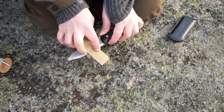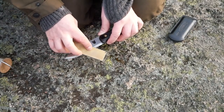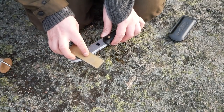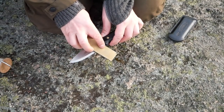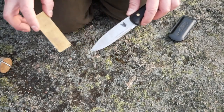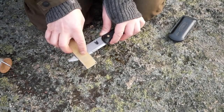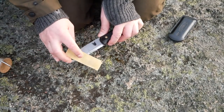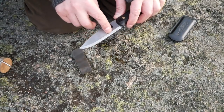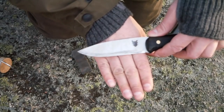Well, that's not all, but that's all with the sharpening stone. You'll actually be able to see it — if you flip it over a little bit then you will see a line. Yeah, there's the line here because I intentionally flipped it over a little bit so that it's not flush anymore with the bevel, and this gray dust will make a line there.